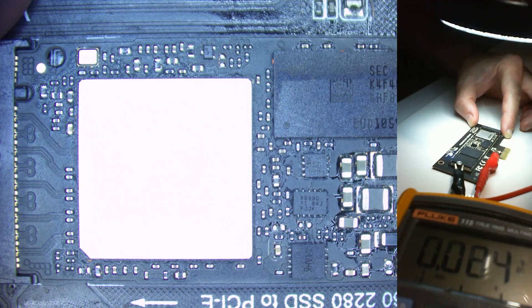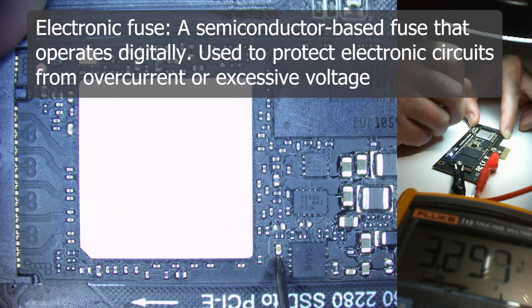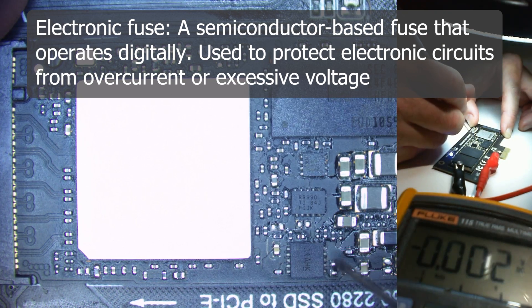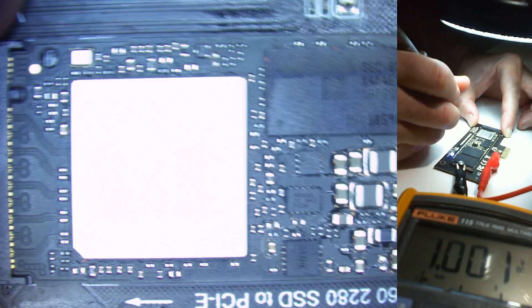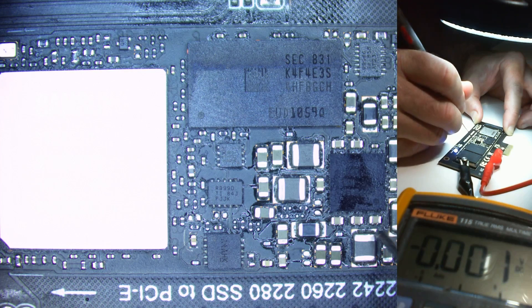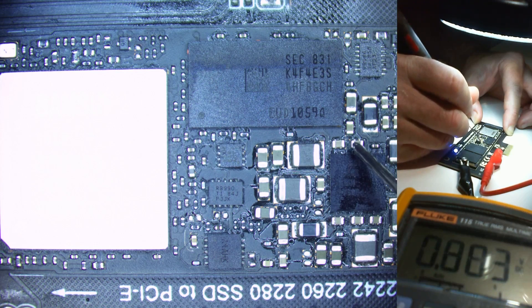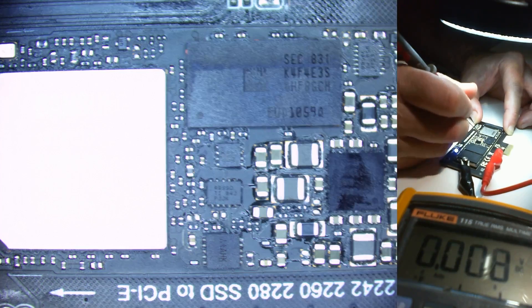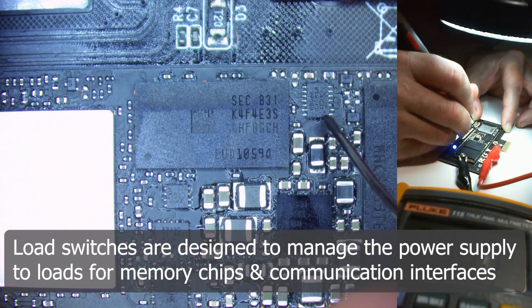Let's do some probing and check all our electronics. I'm going to go straight to the input side of the e-fuse and we've got 3.3 volts — that's good. Let's go to the output side: we've got our 3.3 volts coming out. It's hard to probe directly around the power management chip, but we can get a look at what's happening with these capacitors. We can see ground side, ground side, 3.3 volts, 3.3 volts — a good consistent thing to see for our 3.3 volt logic.